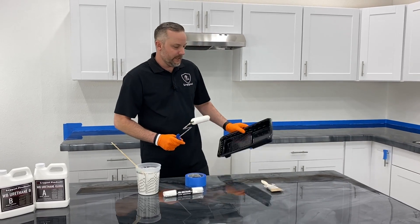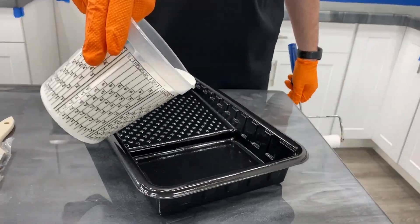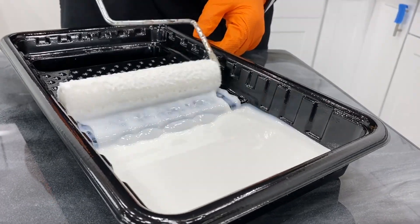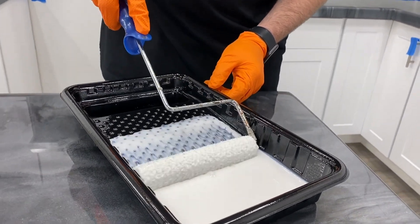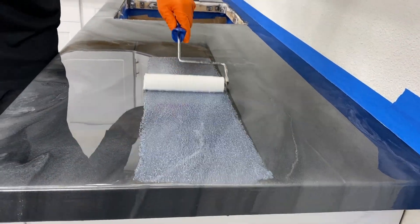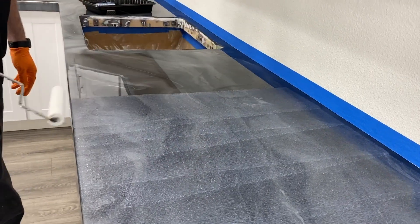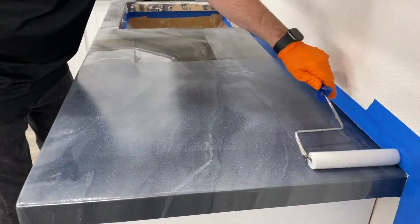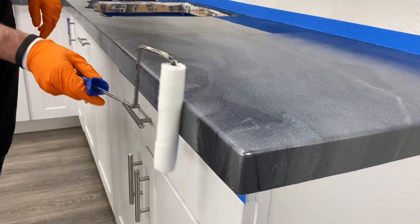So I've got the roller tray here — this back section will be gloss, the middle will be matte urethane, and the small counter gets gloss with grit additive. This is for 50 square feet so we won't need all of it. I always like to take a second to really soak the roller up — if you just barely dip it, it'll be dry in the middle and you won't get good coverage. So take a minute, soak it up really well. We're going to roll a pass down the middle and only do two to three foot sections at a time so I have enough time to roll it out, do my final back roll, and hit the faces.